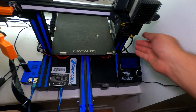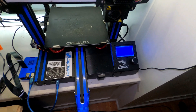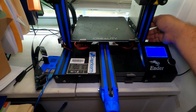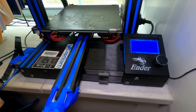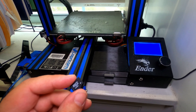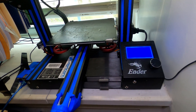The board is back in its home. I powered the printer back up — still running OctoPi — but got a blank screen again. Then I realized what happened: I had put the micro SD card back in without thinking, and it had the firmware I tried to flash onto the version 2.0 board that fried it. So hopefully I didn't fry this new one too. Looks like I need to go download the version 3.0 firmware and try to flash it properly this time.